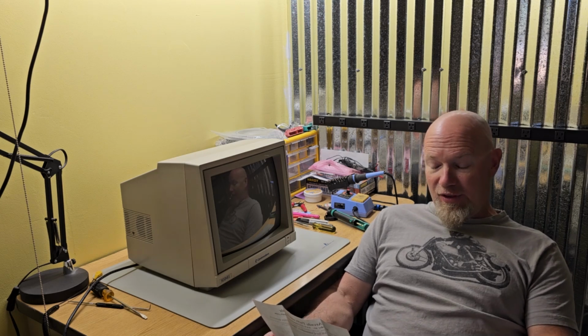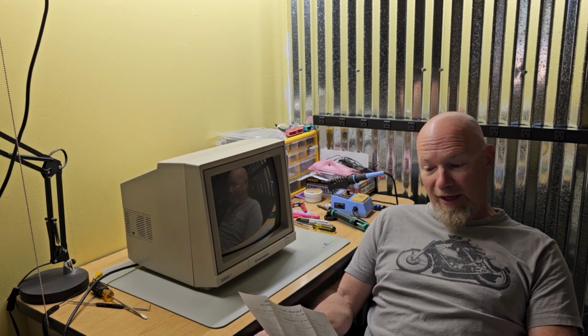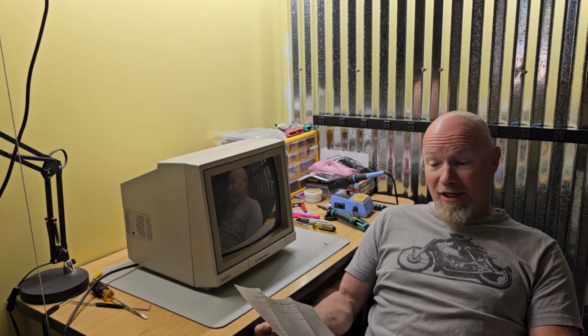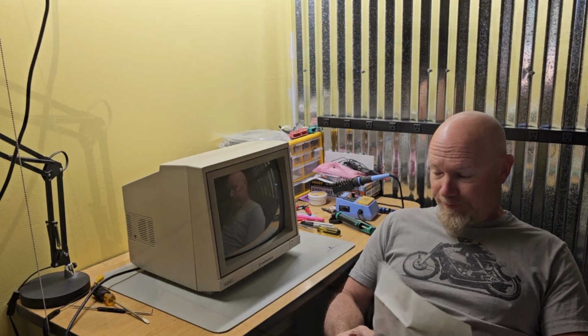They have everything broken down on this page: what capacitors are in the kit, which board they go on, and they also call out the number marked on the circuit board. Like C128 on the board will have 100 microfarad at 25 volts. So you can make sure you've got the right capacitor in the right spot. With 54 of them, there's a chance of getting confused. So, good kit. Let's get this pulled apart so we can start changing capacitors.